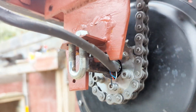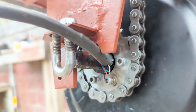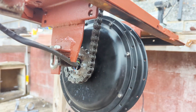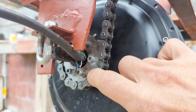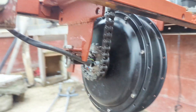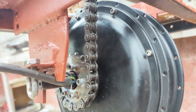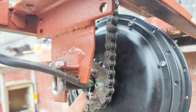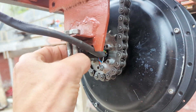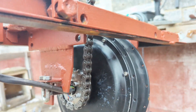There's the up spot and there's the down spot. What that may mean is that this isn't centralized properly, which is fine — that will be a job that has to be done. We need to have this motor fixed in. Even though it could be held in by the chain alone, that isn't acceptable, so we'll need to adjust this and check it — if we tighten it all the way up, that movement has to go somewhere, so we have to get rid of that.